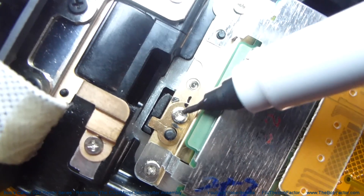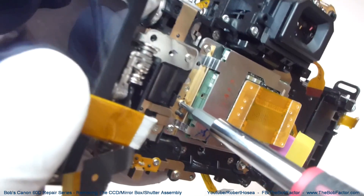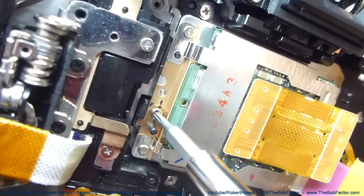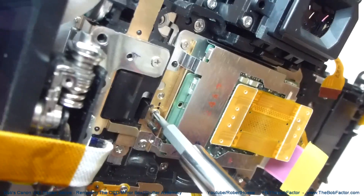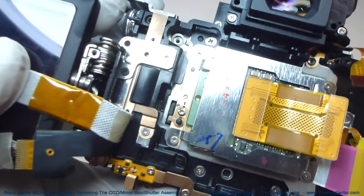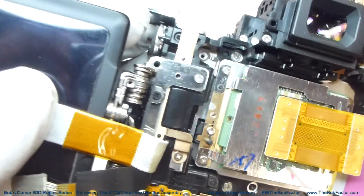You can see on this screw where I placed the mark on the screw and on the plate below it. We'll turn the screw clockwise so that it's seated all the way down and count how many turns it takes. There's one turn — you can see my mark is lined back up again. Now it's on the bottom; we've gone one complete turn plus another half a turn. So this screw, when we put it back in, we'll screw it all the way down and then back it out one and a half turns and it'll be right back where it started.